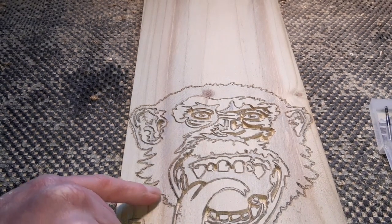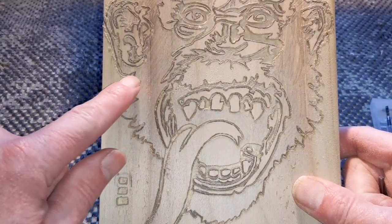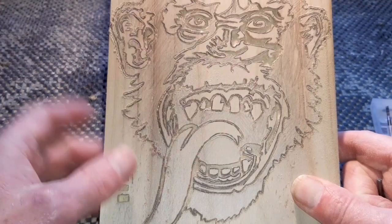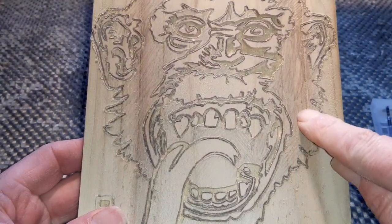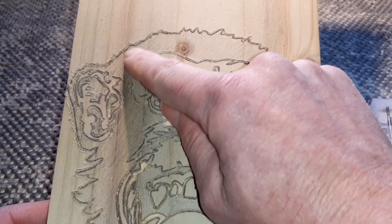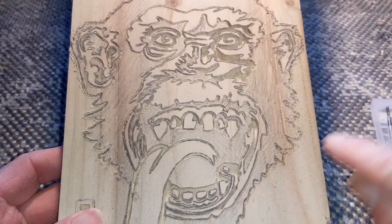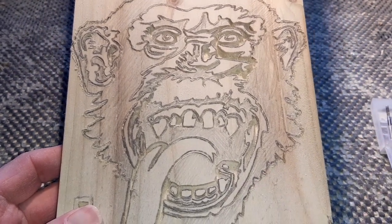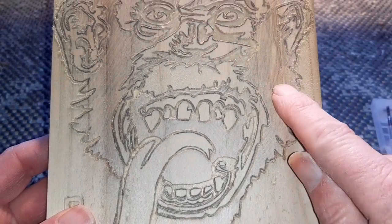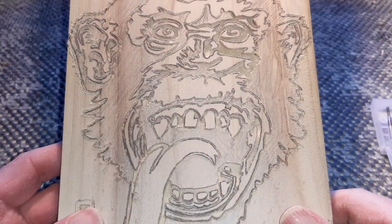Ideally, this would have been cut out first, and I've done it on other projects where we cut it out first, because obviously you've got a better line to follow with a pencil line. And then I leave it in this framework and then route over the top to remove the remainder. However, I'm just going to chance it on this one, because it is quite rough and ready around the edges. We don't have to be too perfect. If one ear stands up higher than another, it doesn't really matter. So we're actually going to route it all out as if it's a finished project, and then we're going to scroll it out afterwards. It makes it a little bit harder. Obviously, it's easier to follow a pencil line than it is to follow two different depths. Because remember, this bit will be routed out, this bit will still be normal. But it's no problem. These things are sent to test us out.